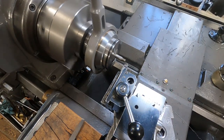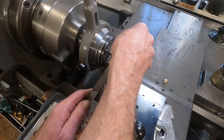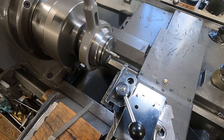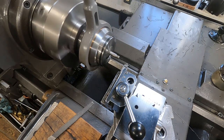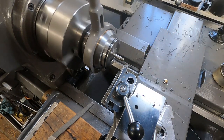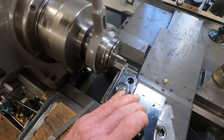This time I'm thinking it's very close, if not already there. I'm going to move it in two thousandths on the cross-feed straight in, to shape both flanks of the thread — about two thousandths. We're forward. Gauge it.